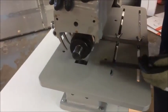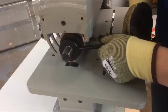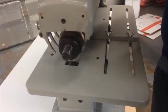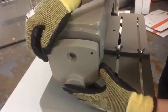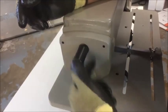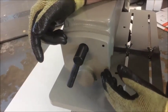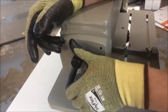Then you're going to use the bar again to tighten things up. Sometimes one end works better than the other — it's a kind of odd-shaped bar, but that's what they provide with the machine. Once that's good, get the top cap or end cap, line up the pins, line up the bearing, and seat it in place. Then install the bolt or handle depending on which your machine has. This does not have to be gorilla tight — just snug it down. All it's doing is keeping the end cap from walking off the end, and if it starts to get loose, you'll notice it anyway.